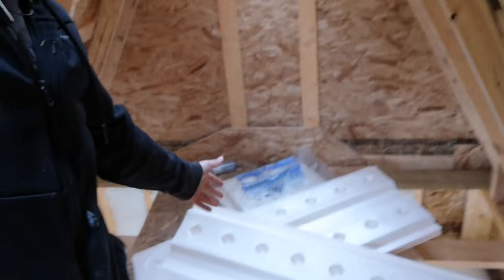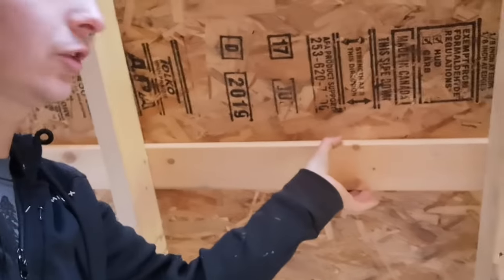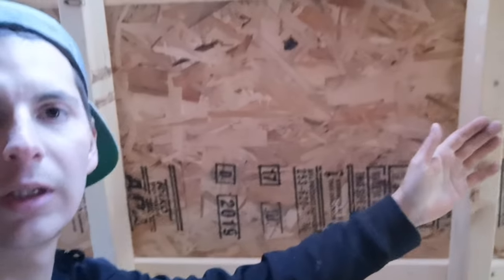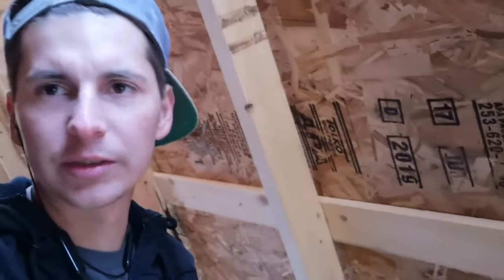This one is going to be just like that with a cover on it, of course. We have a few things in mind, but for now, I'm going to take these baffles and staple them on here. So we have an extra 3/4 inch of space beyond what that gives us, and then we can put our insulation beyond that, and then we're gonna clad this with some sort of panel board or something like that.